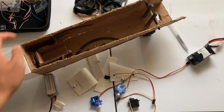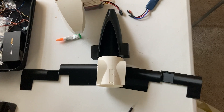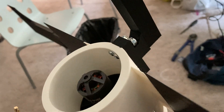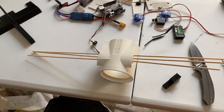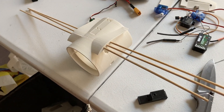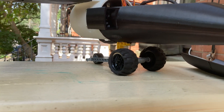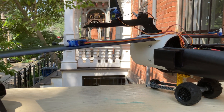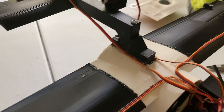For the next version, I went back to using all PLA+. I made it much more compact by integrating the EDF right into the fuselage, adding vents for air intake. I made a lighter tail design, with all lifting surfaces above the center of the fuselage, and kept the high aspect ratio glider wing. This time I added skewers as rods through the wing, which held the wings up very nicely. The design came together smoothly — the tail bolted on through the top of the fuselage, and the wheels are welded onto the flat bottom surface. I was shooting for 700 grams, and the final design weighed in at around 750. After modifying some parts, the plane is overall very structurally sound.